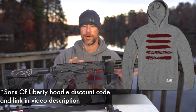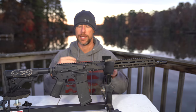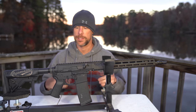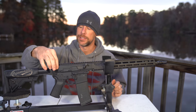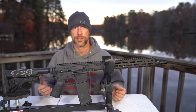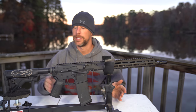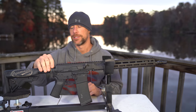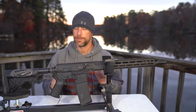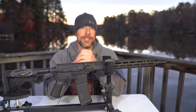What they wanted to do is modify that operating system to make it work with any of your standard AR lowers. The big key that's really different about this is, number one, it's piston operated just like all of the AR-180 style rifles are, and the actual operating system is contained within the upper receiver. So big deal for folks who want to run folders — a lot of folks use the Law Folding Adapter and others to use it on their AR-15. Well, this can use any folding adapter because there's absolutely no need for any sort of buffer system in here.